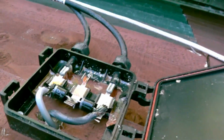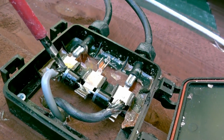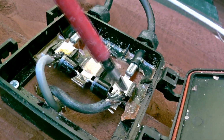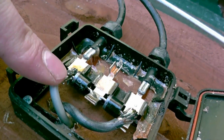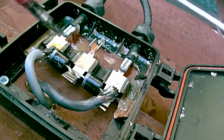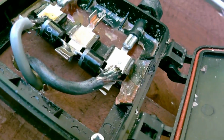So looking at this upside down, you'll see that I've screwed this into the back of the shed. Got the two leads leaving. However, this device is actually meant to alleviate the shading on panels by passing them through diodes. However, this is now in reverse because we're putting power into this and into the shed rather than taking power out of this into our charge controller or microinverter. So these diodes are facing the wrong way. I'm sure the panels have got them in already, so we're just going to cut these out.